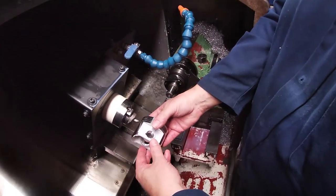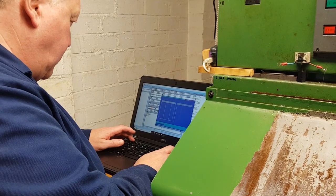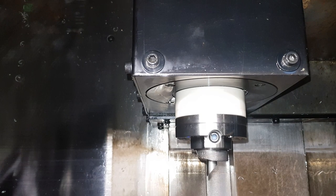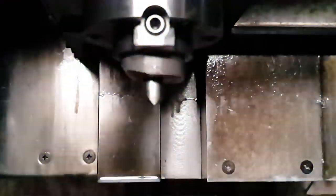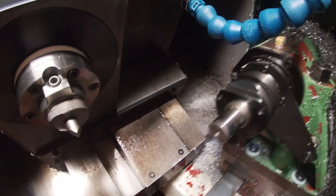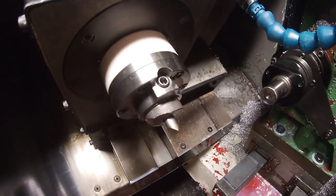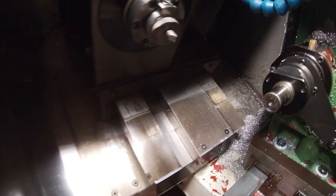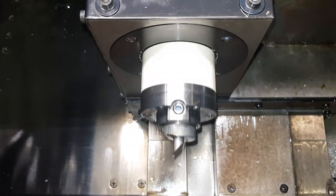Normally the piston will be sitting on the fixture rotating at 1,200 RPM, but we haven't got the fixture in at the moment. Here's a program I've created to show you how the skirt profile is generated. Those movements have been magnified around a hundred times. This is the ceramic quill generating the ovality, or the ellipse — super slow motion. The black axis on the outside moves in the same direction as the ceramic quill but is mainly used for positioning. The ceramic quill is what generates the profile along the skirt and around the periphery at the same time.